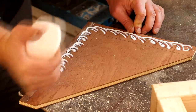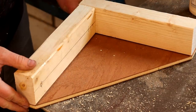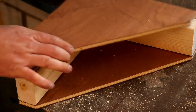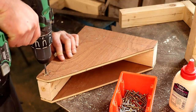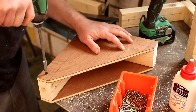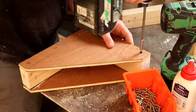I cut the shapes on the bandsaw. I could then add glue to where the L-shaped pieces would sit and start assembling the brackets. These plywood braces are going to be what makes them really strong and heavy duty, and I secured the plywood braces with a few screws.